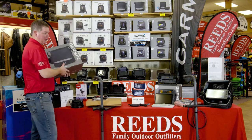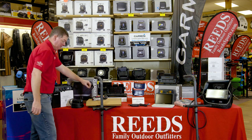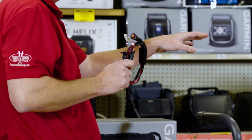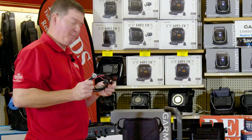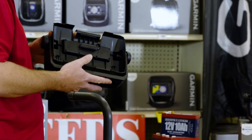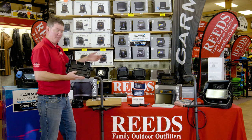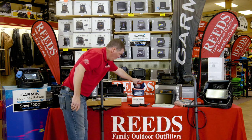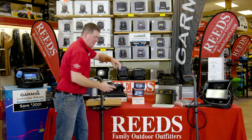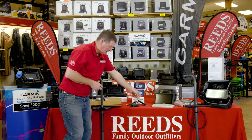The extra large kit holds everything together — your black box and all components mount in there. We're also going to include the dual power cable, which is pretty cool because it keeps all your cables in your boat in the summertime. It'll also power not only the 93 but also the black box — that's the dual portion of the power cable. Also included is one more bail mount that mounts in your extra large kit, so you're just moving the head back and forth from your winter kit to your boat. To power this, we've got the Dakota 12-volt 10 amp-hour battery, and you'll want to use the Dakota battery charger so it charges that battery up to 100%. That covers all the components for use both summer and winter.